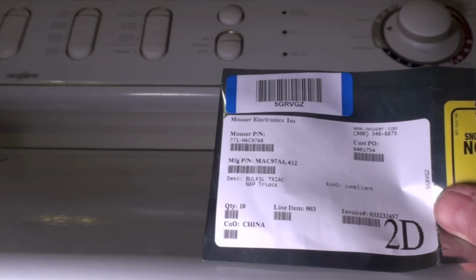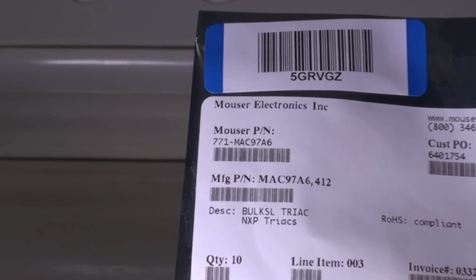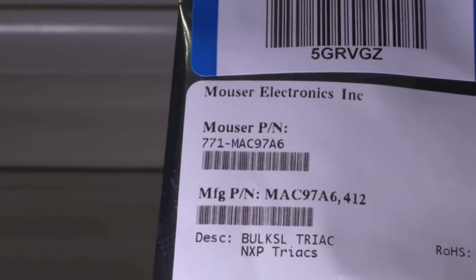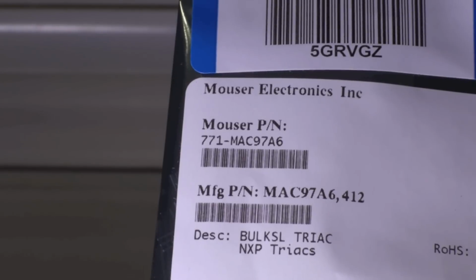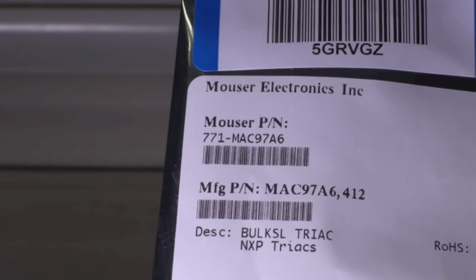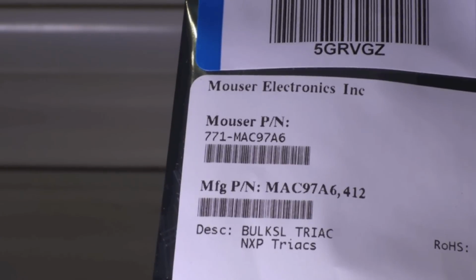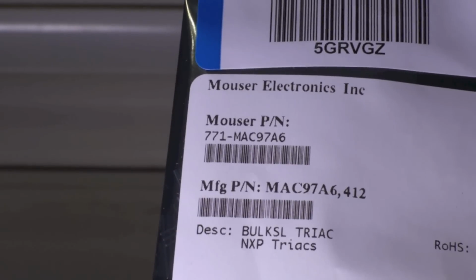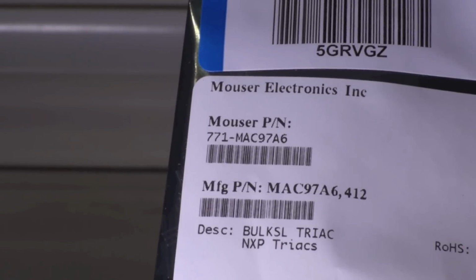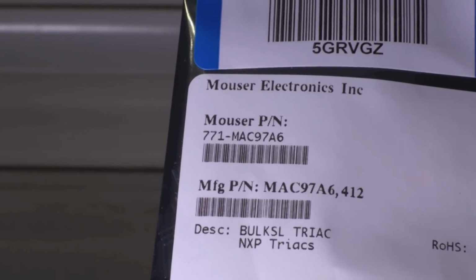Okay, I picked up this triac. See if you can read that part number. That's what I ended up with. Oh, I think these are about 40 cents apiece. I did look on eBay. There's a guy there will sell you a kit which consists of the wax motor, that little resistor, the 3.9 kilo ohm resistor, and this little triac, and he wants 50 some bucks for it.